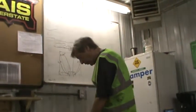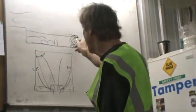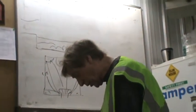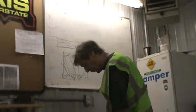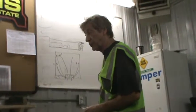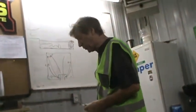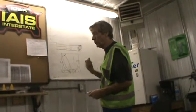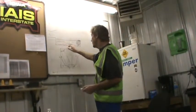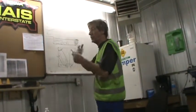Remember particularly with the sort of coal you're getting — most of your heat and most of your coal burns before it hits the bed. Your coal burns between the firing table and hitting the bed. So most of your heat is released before the coal gets onto the fire bed. But with the sort of coal we get with the big lumps — not this stuff — the coal doesn't get a chance to burn on the fire bed. It lays on the fire bed and two or three minutes before it's burned away. So you don't have that problem with our coal — that's what forms a clinker. Particularly if you're firing to keep up and the engine's not properly warmed up, you're putting in more coal than you need and the coal doesn't get a chance to burn on the fire bed. You put more on top of it and the next thing you know you've got clinkers.